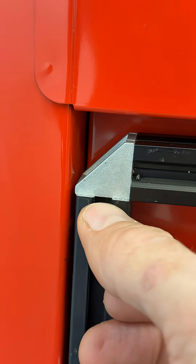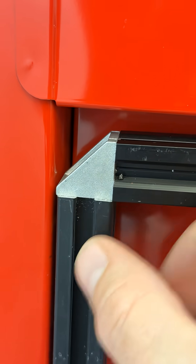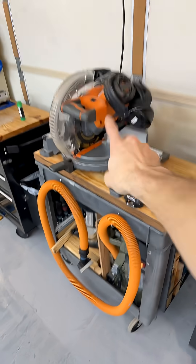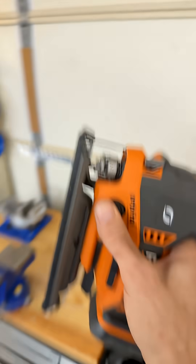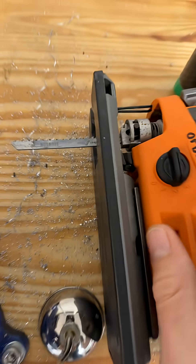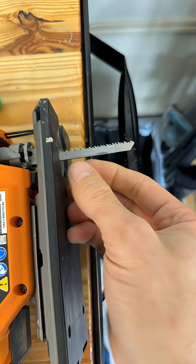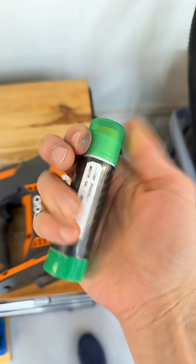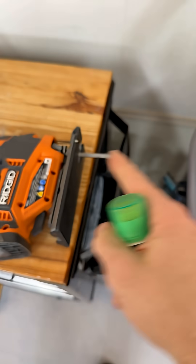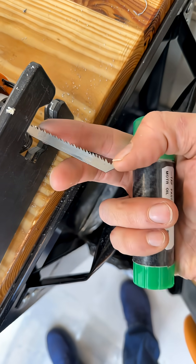Look at the flushness of these edges. Usually I would need the circular saw, but I got away with something easier. On this blade, we chose the clean wood type. Wood blades will cut neatly and nicely for the aluminum, and that is where I applied some of this tap paste to help it come out clean, and we got zero aluminum debris hung up inside of our blade.